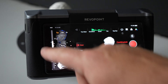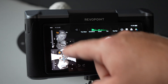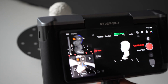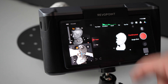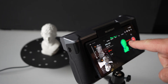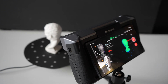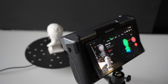This little indicator here is the exposure — if it's red, it means it's overexposed; you really want a mixture of red and blue. Up here, as you move the scanner closer or further away, a red or green marker shows if you're in the optimum area for scanning. This is the actual scanning window showing the point cloud as we scan. I'm going to scan this for about three revolutions — first at mid height, then holding the scanner higher up, then lower down.